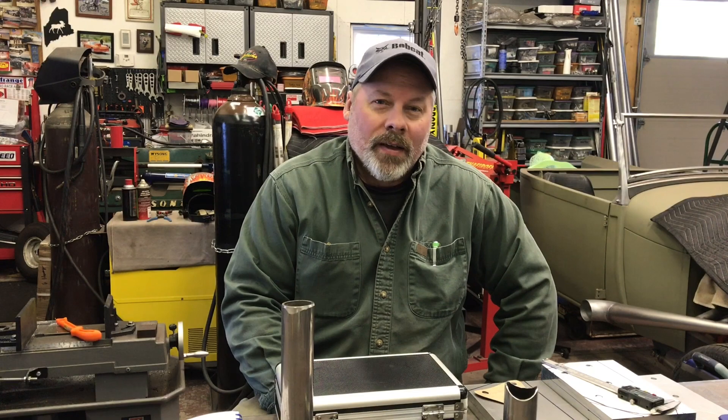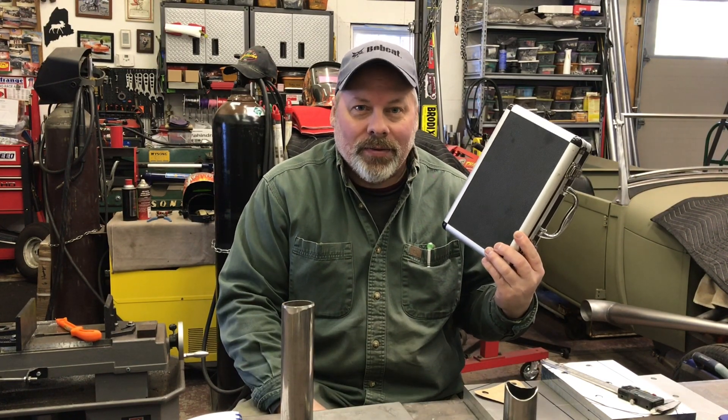For this reason I bought myself an inexpensive sonic checker — it's like $65. It's actually so cheap I have to convert it from metric to decimal, but that's okay. Before I'm going to add on something or go buy a car, I'll take that with me, and just like the sonic checker the guy uses at the chassis cert, you put a little grease on the tubing and it measures the thickness for you.